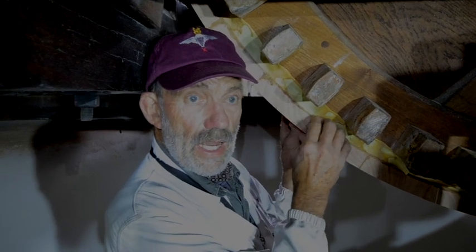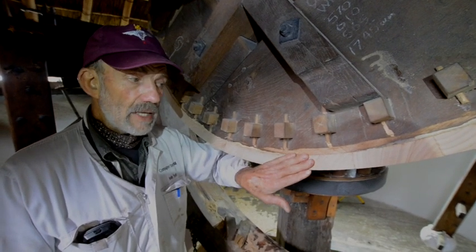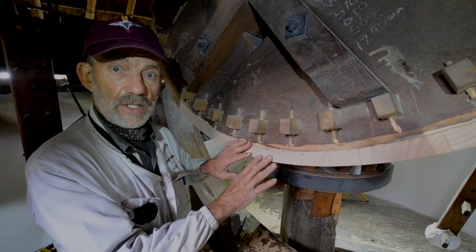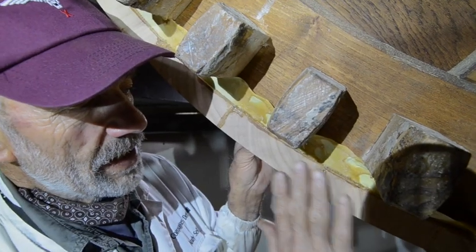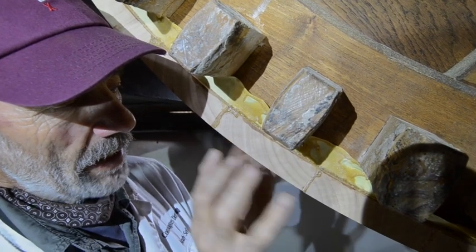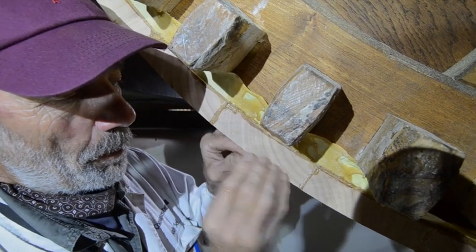At this stage it's about 31 millimeters at the thinnest, and we decided to stop. The last job we did on our last visit was to face this — remember the blocks were slightly too long for the width of the brake wheel. We used an electric planer, dismantled out of that special jig, and planed and then sanded the surface. The rotation of the wheel is that way when it goes in the brake, so we deliberately looked at the end grain of each block and turned it so that there would be no tendency while the brake was on for the grain to peel off.